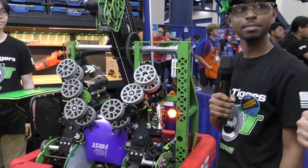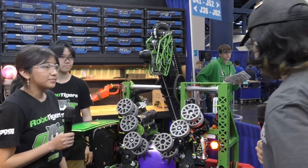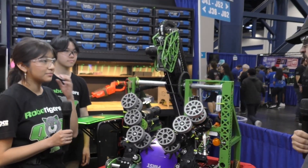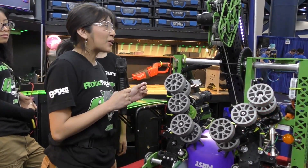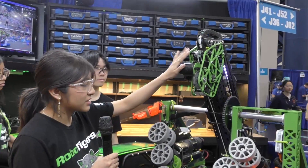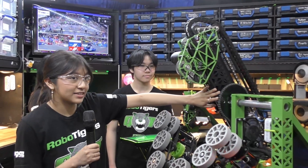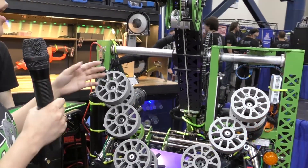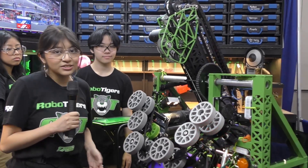Now that's a good transition to your arm mechanism. Lindsey, talk about your arm and how you have an absolute encoder system to get the gear ratio for your arm — the rotation and extension. So our arm is a three-stage telescoping cascade arm. As you can see here, we have three gearboxes on here that are all custom made. We have one for extending the arm, one for pivoting at the center of the arm, and then at the far bottom we have one for the wrist for the scoring delivery. All three of these gearboxes were custom made because we couldn't find any that really fit our design, so we just made them ourselves.